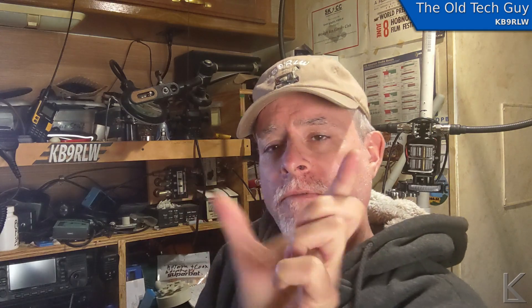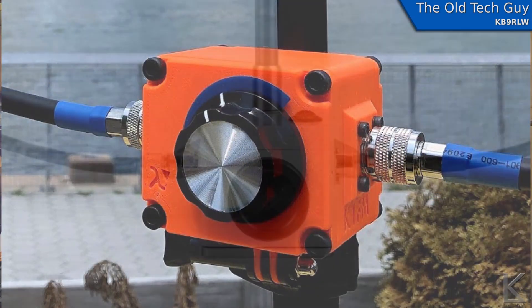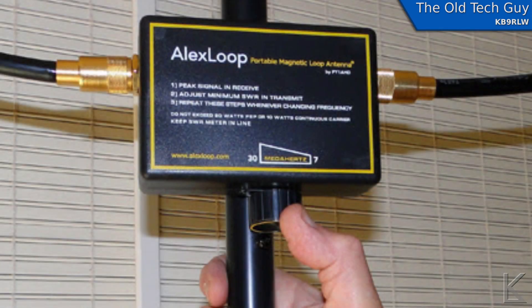It really made an improvement. Before, with the loop with that gap, it was on either side of the capacitor where I brought the ends of the loop in, which is a pretty common method. If you look at magnetic loop builds, you'll see that the loop comes down to either side of the capacitor box, and you end up with that big gap. So I thought, let's bring those two closer together and close that loop up. Before, the SWR — I could get it down to below 1.5:1, maybe 1.3:1 pretty regularly, but it was difficult to get much lower than that.